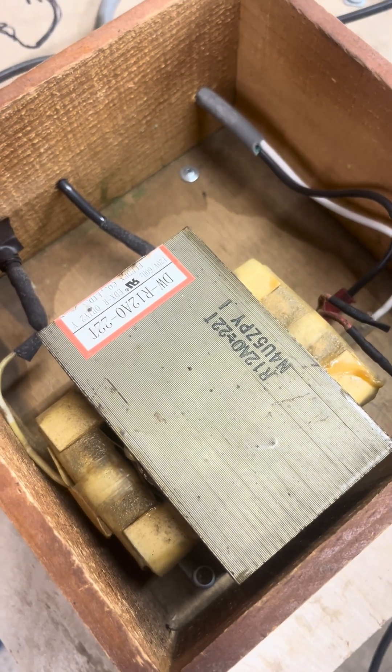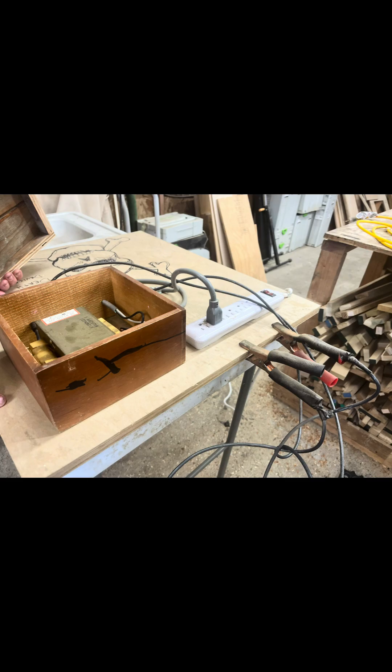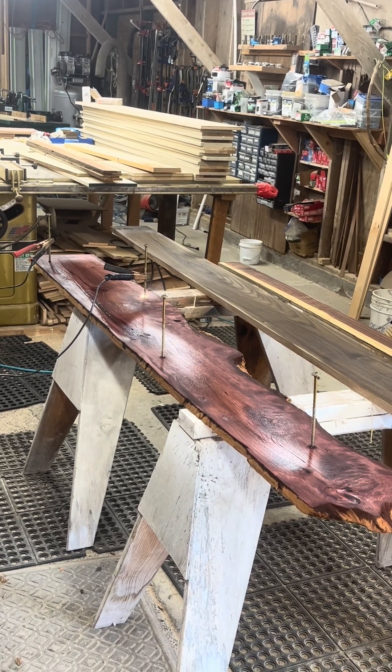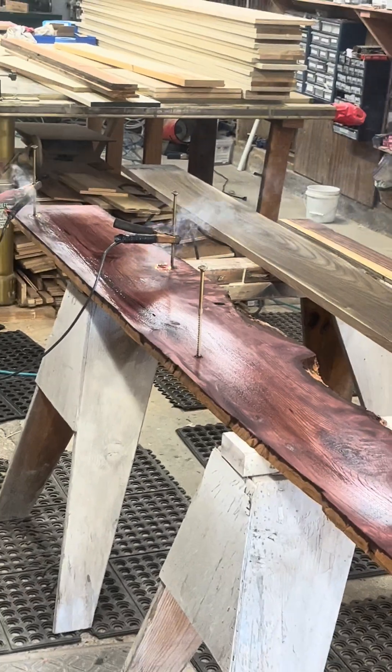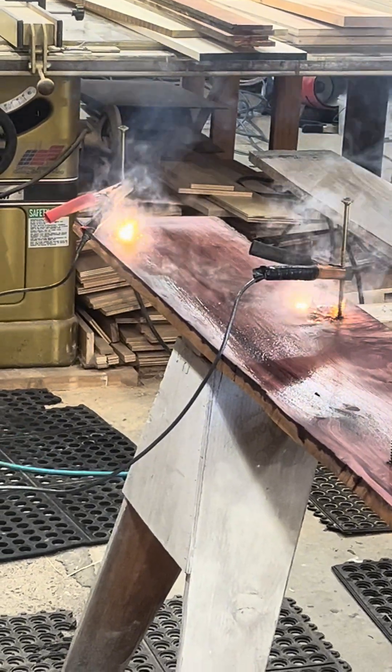This is an old microwave transformer from the 1970s. The transformer has two coils in close proximity, and as the AC alternating current passes through the first coil, the magnetic field it creates will prompt a current into the second coil. This is a magnetic force that will push and pull on the free electrons causing them to move. This changes the intensity and polarity and is called the electromotive force, or EMF. Basically, this transformer takes the electricity from the wall at 120 volts and changes it to about 2,000 volts.